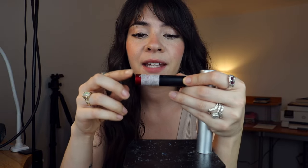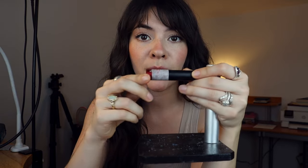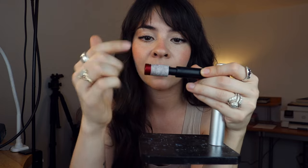And it's nice because it sits on top of my bench. So with this, I can either create my rings directly on the mandrel. I use masking tape on each little mandrel so that the wax doesn't peel up as I lay it on there. So with this mandrel, I can either start the ring directly on it, or I can cut it out with this and then attach it to the piece, and I have better control and I can rotate it around, and it's made a lot of the work so much easier having this.